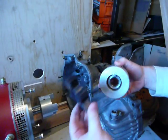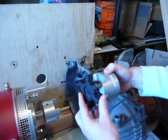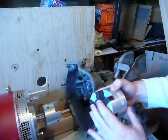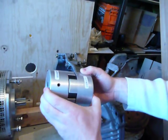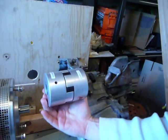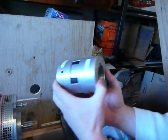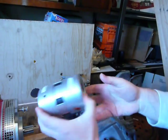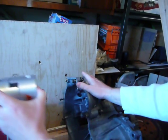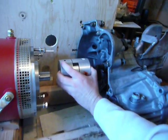There's a rubber spider that goes between — as you can see it slides on like this — and this end also slides on like this, and that forms your complete coupler. The motor shaft goes in here keyed, the transmission spline slides in here keyed, and you bring the two pieces together for a direct drive.